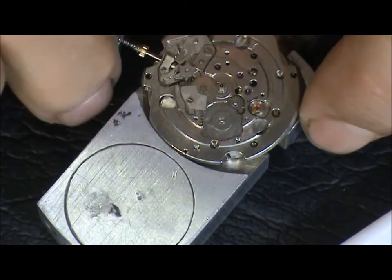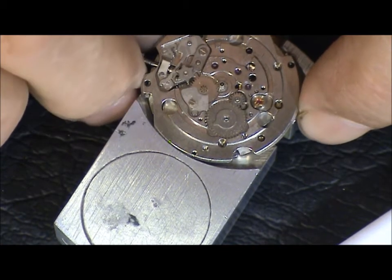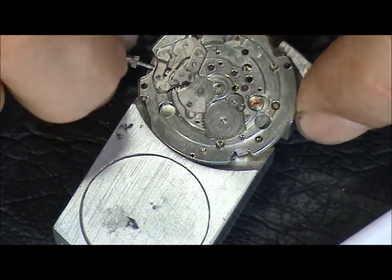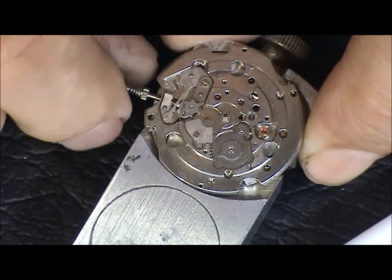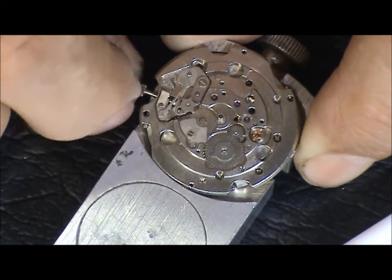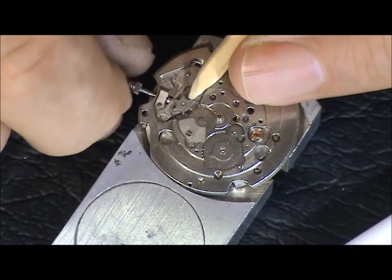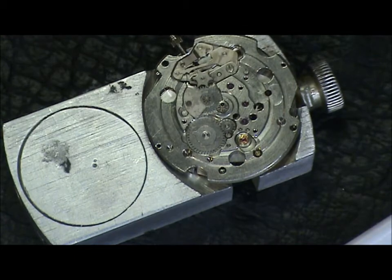Okay. Now then, that's turning, no jump. Much smoother, look at that. It was that cog, worn. That cog was worn. So now she's working like a purler. Much better. Put a bit of weight on it and see what happens. Yeah, look at that, no jump. Yep, that cog was worn. Thought so. My deductive reasoning there.